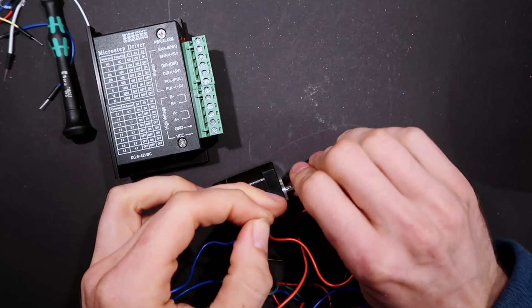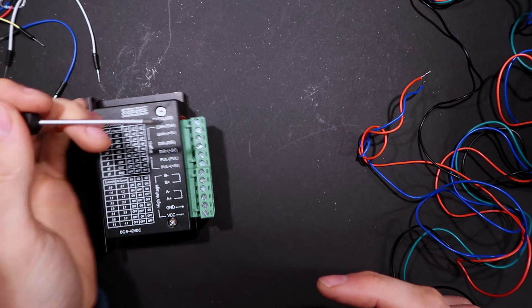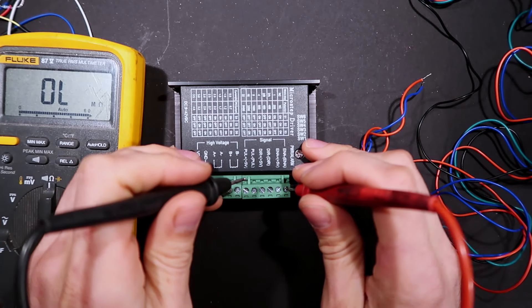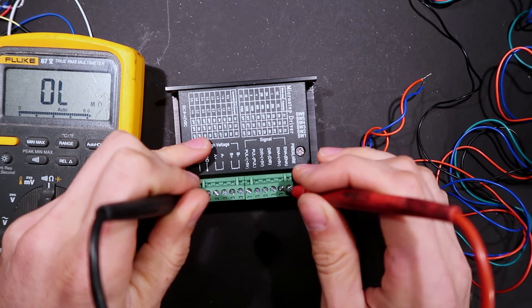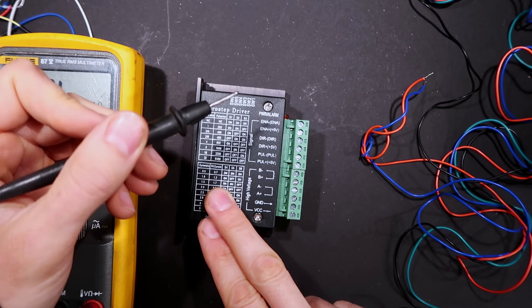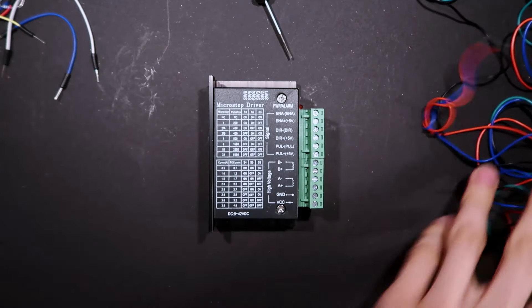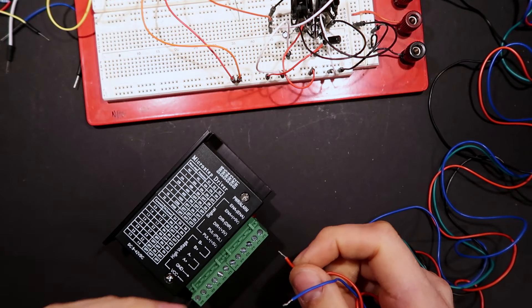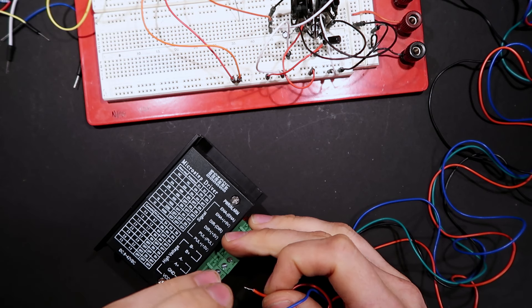We need to build a little circuit to provide a pulse. These inputs are interesting — there's enable minus, enable plus, looking like differential pairs. I'll go inside and get my multimeter. Enable minus and direction minus are open to the main ground — zero volts between these two. So these are all differential pairs; reference to the other pin you should have five volts. I've got a 555 chip built up here but no datasheet, so I'm just going to try it — it's not going to hurt if you put it in backwards, it'll just not work.